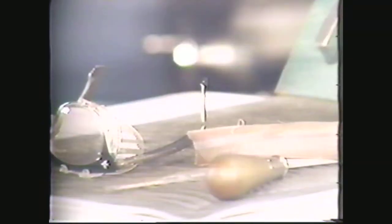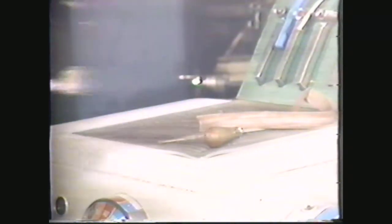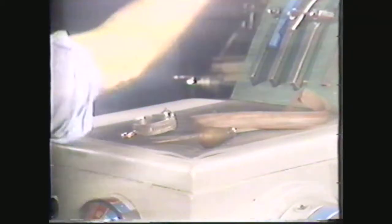When filing and polishing, you must take certain safety precautions to protect yourself and the people around you. Always wear your safety glasses. Remove all watches, rings, and jewelry. Roll your sleeves up above the elbow. Never use a file without a handle. And remove any threads hanging on the end of the polishing paper, as they can wrap around the workpiece.